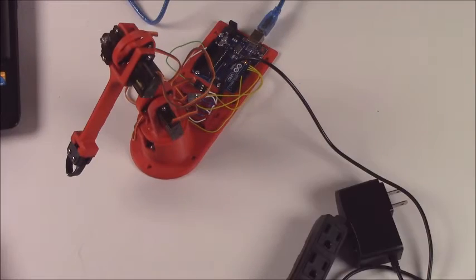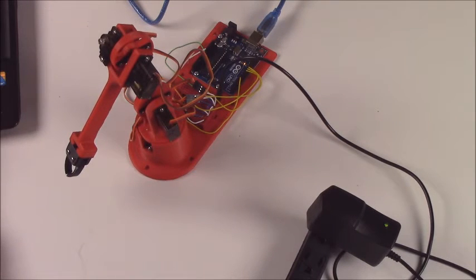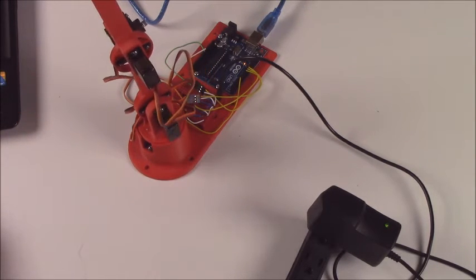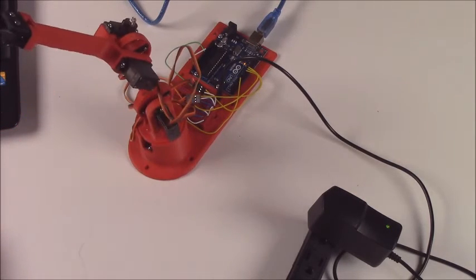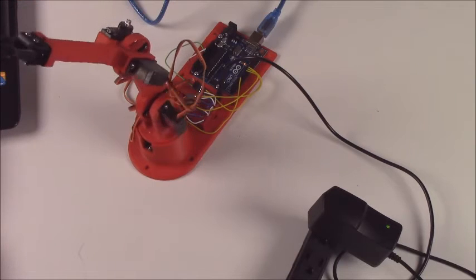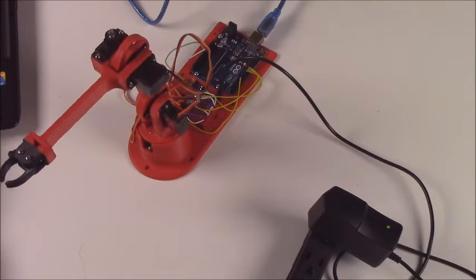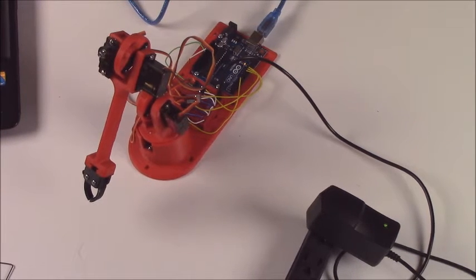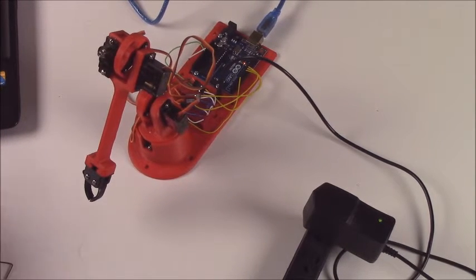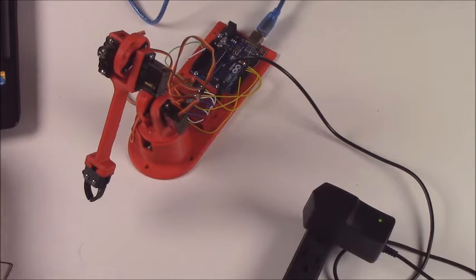Once you're done mounting the servo, go ahead and plug it all in and test it out, and your arm should move something like this. If for some reason your arm doesn't move, or something gets jammed at the elbow, then just move the servo to the opposite extreme and remount it in the exact same position, because it means you got something backwards, and instead of expanding the arm, it's trying to curl the arm up even more from its closed position. Just do a quick test, go through everything, and that should be good.